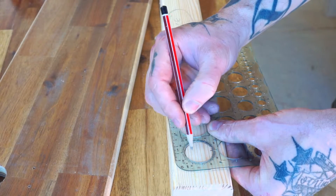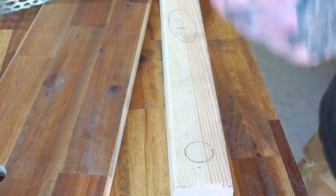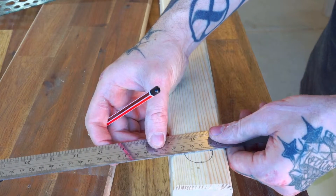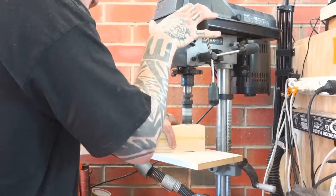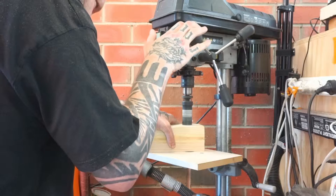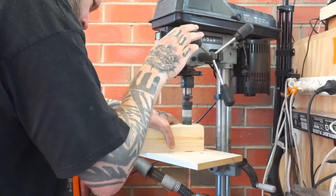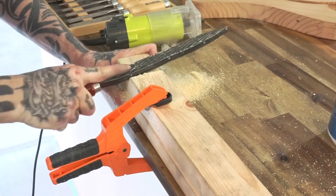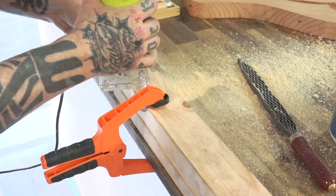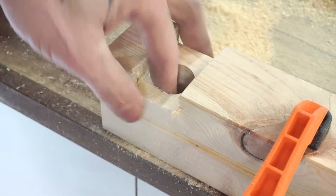These little circle templates are really handy to have, and quite cheap online. I'm plotting a central point so I know where the drill bit in the center of the hole saw will hit the wood. The hole saw isn't long enough to drill through the entire spacer block, so I just start it off in the drill press, move to a rasp to hog out material on the other side, then finish it off with a hand router. I think that's deep enough — now we can see our hole.